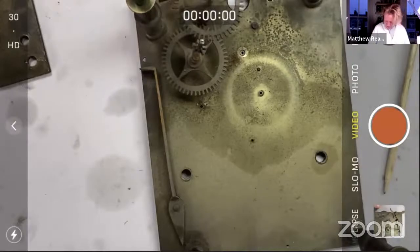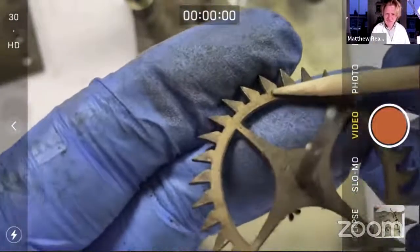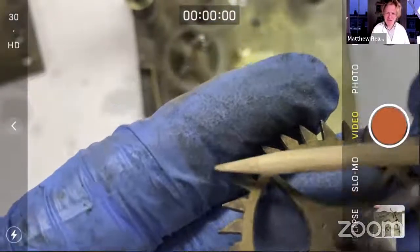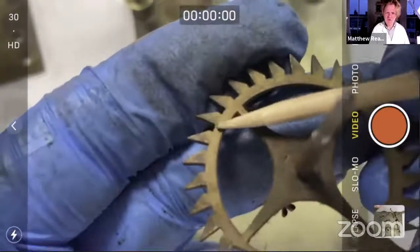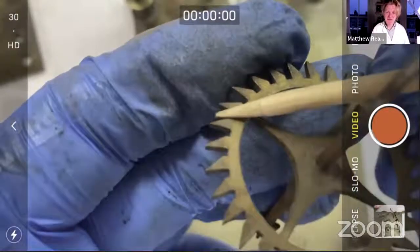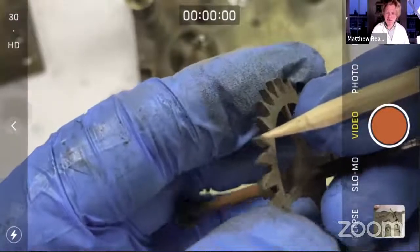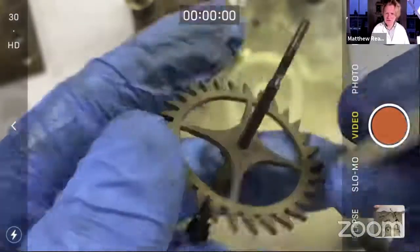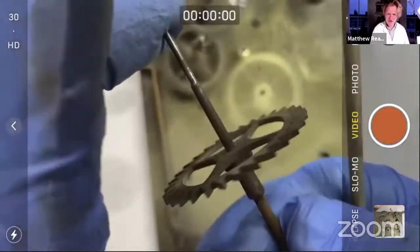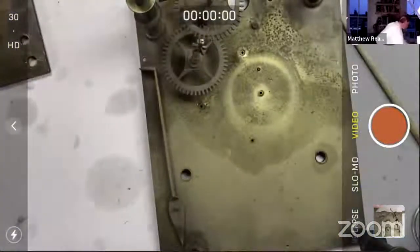Yeah, really nice. So there's a manufacturer's mark, which you just about see here, that they've put on where they want the root of the tooth to be when they're making it. So that dictates how far in they come with their cutter. And then of course, the depth of penetration of the second cutter is when you get down to having very little land here. So that's nice. So this is in good nick. It looks reasonably straight. Yeah, no problem there. So just a bit of cleaning on that and sorted.